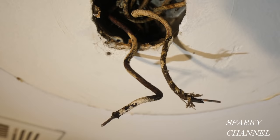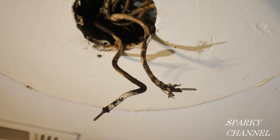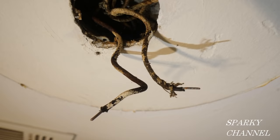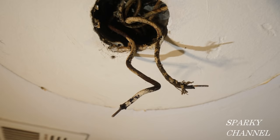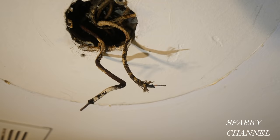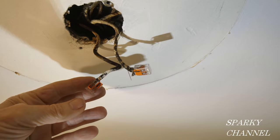So you could guess, but that can be dangerous. I'm going to show you how to find out which one's the hot wire and which one's the white neutral wire, and go over why it's important to get them straight — putting the black with the black and the white with the white on your light. The circuit breaker is off right now, which it should be when installing a new light, but I'm going to have to turn it back on to make a test. For safety, I'm going to put wire connectors on both ends of the wires first.